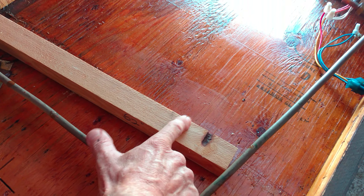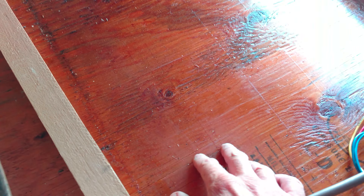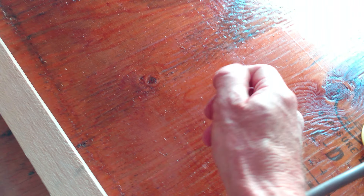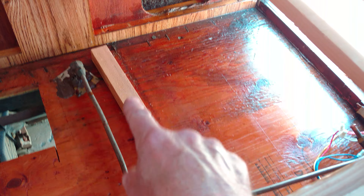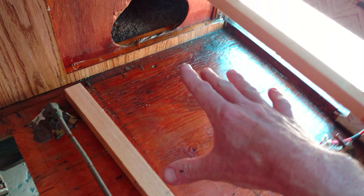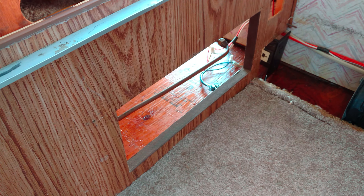Here's where my furnace goes — it sits up nicely, about under two inches off the surface on little pegs. I coated the wood with spar urethane, two coats, and I even tested it by holding a flame to a sample piece to make sure it's flame-proof. I'm also making a 22-by-22-inch sheet metal heat shield from Home Depot that goes underneath the furnace. I'll glue it down with a couple of staples and that'll give me peace of mind.